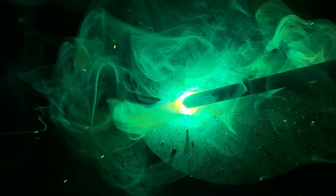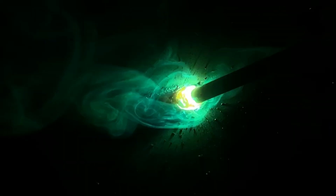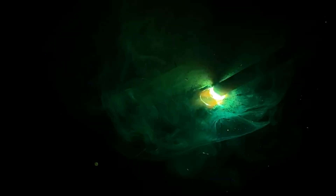Now we're going with 7018 — this is an eighth inch electrode and we are running at about 120 amps on DC electrode positive. We're keeping a tight arc and going in a straight line. A technique I learned from Welding Tips and Tricks on YouTube is that you can almost lay that rod into the joint and let it burn by itself if your amperage is set properly — letting it do its own thing and letting that weld puddle build up accordingly.